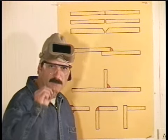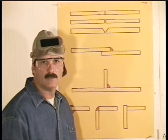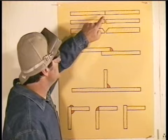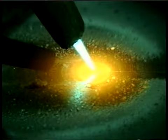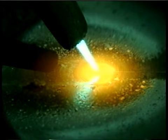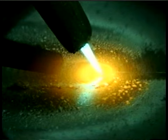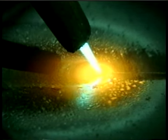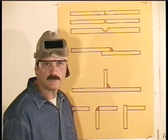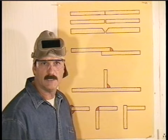When you're working on the thinner gauge metals, the edges will get extremely hot and melt away. So butt the 2 pieces tight together and tack weld both ends. A fit up like this can be fused together simply by moving the puddle along the seam. This produces a flush weld joint, and the strength will depend on how much penetration you get. If you have any concerns about the strength of the joint, add filler metal and build up weld bead.